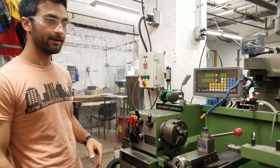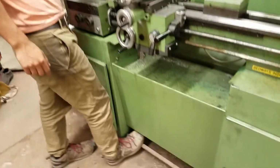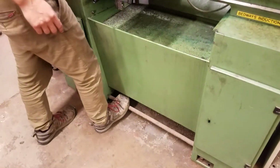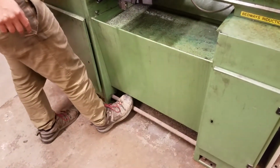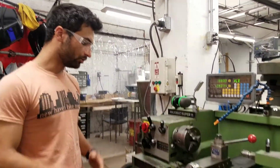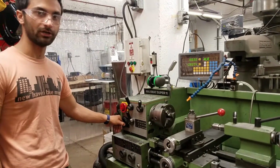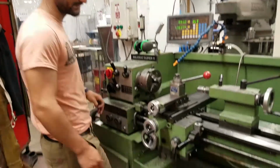The brake on the other lathe is over here, it's that handle. Here the brake is down this foot bar. So when you're working, you have your foot on here and push it to turn the tool off, which is kind of a cool feature. Normally, you can just turn the handle though. So let's say it's spinning, and then you just turn it off. The brake is only if you want it to stop fast.